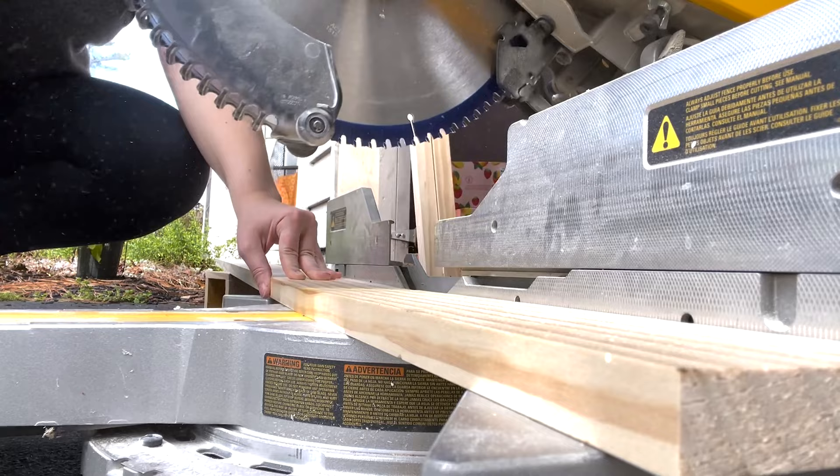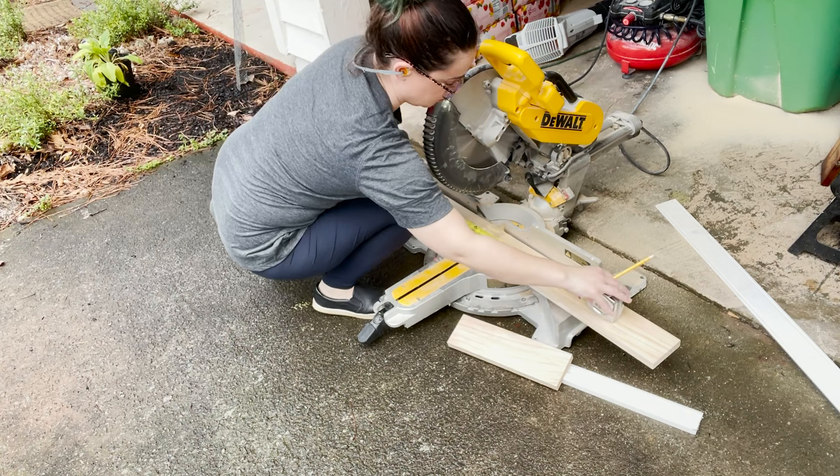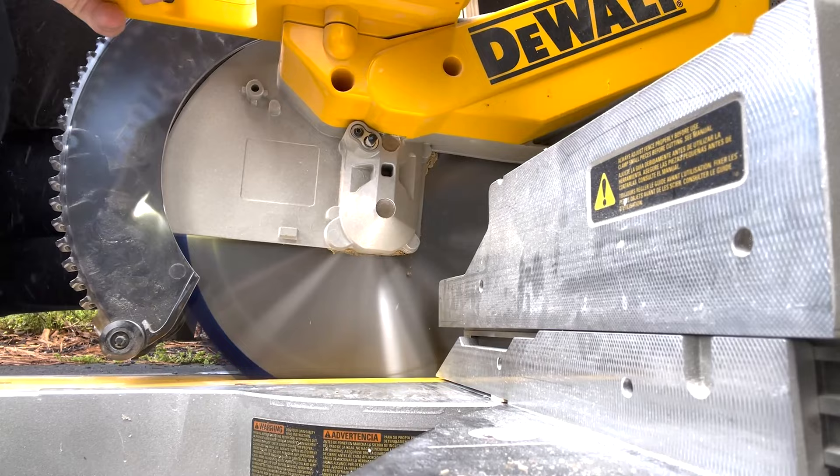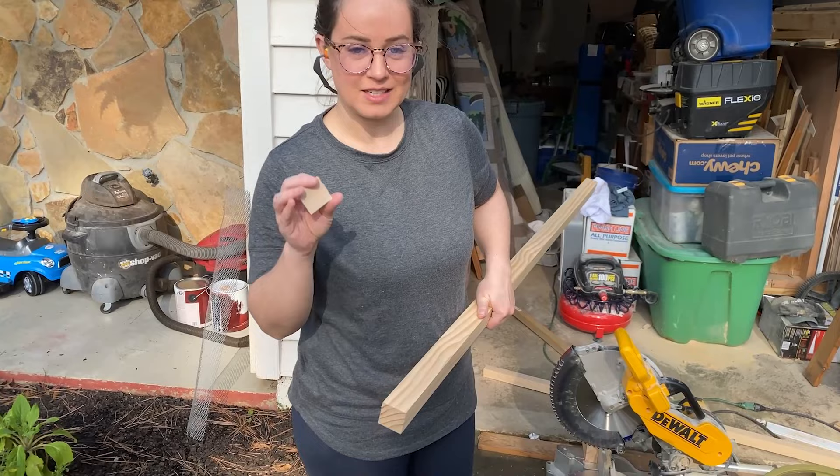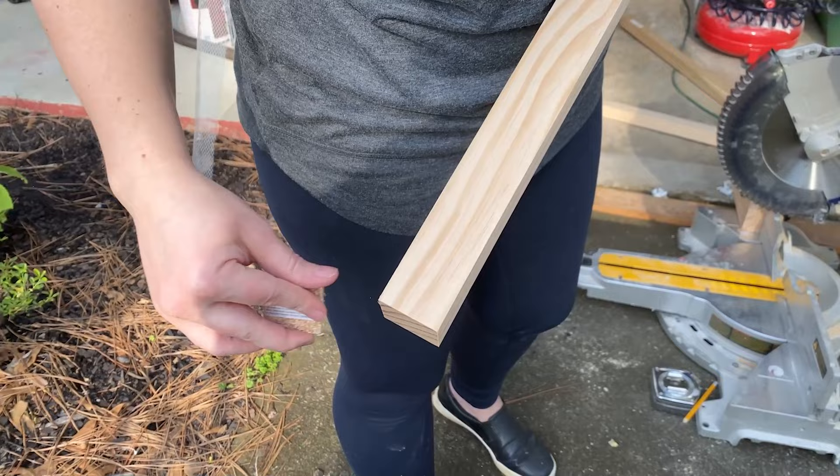Another quick tip: don't rely on the ends of your lumber to be perfectly square straight from the store. Instead, cut the ends yourself and then make your measurements. This helps to minimize gaps and make sure that the pieces from your project line up straight. I've always found that if I ever get a little bit of tear-out, nothing major — I can take a tiny piece of scrap wood and just run it along the cut and it mostly just disappears. Almost like using sandpaper, but not really.